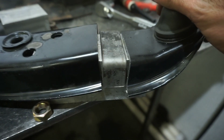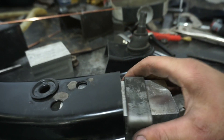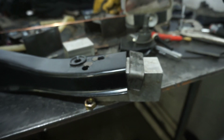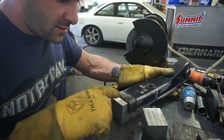It gives you a good idea whether or not this may not be perfect, but you can get this piece and the other piece perfectly aligned, and that is important. I would recommend getting something flat — it doesn't have to be aluminum, it could just be a piece of square tubing to help you align these faces.